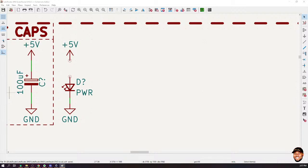0.06, right? 0.0625. Okay. So you see, 0.0625 is still bigger than 0.03, true? So that means you can conveniently choose this resistor wattage, if it exists. However, my rule of thumb is usually to choose twice the required wattage. That's what I do in my circuit. So twice this is probably going to be just 0.06, but I'll still go for 1/8 watt, or better still, just go for 1/4 watts.